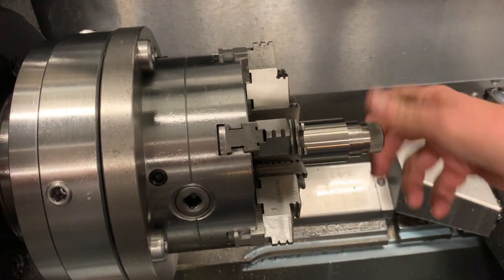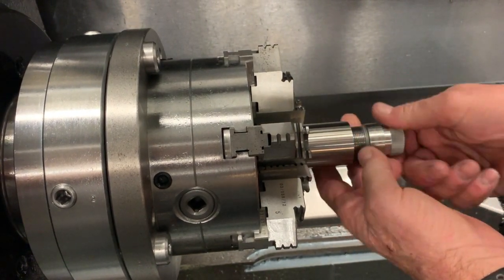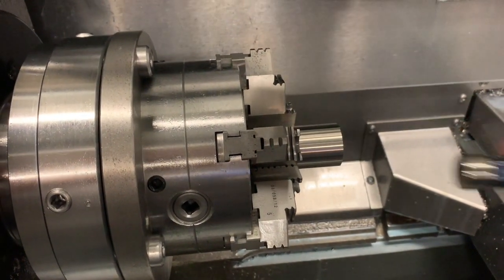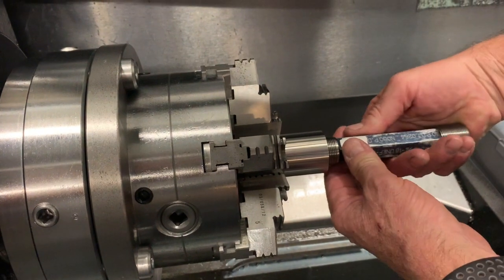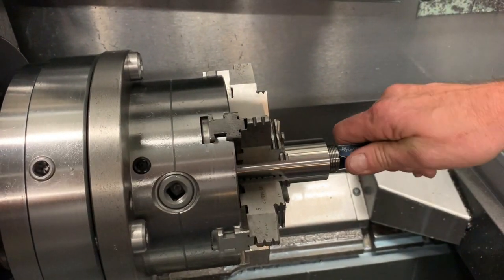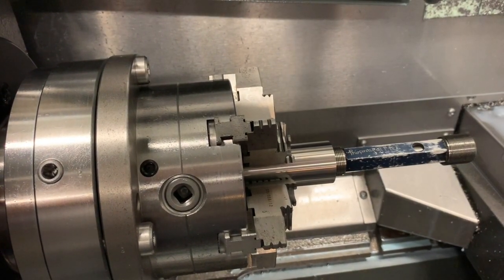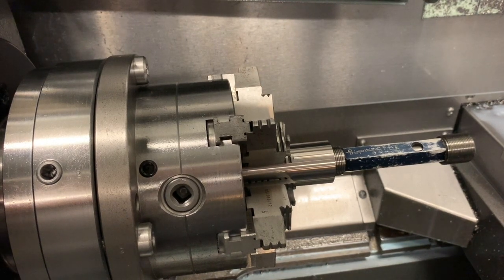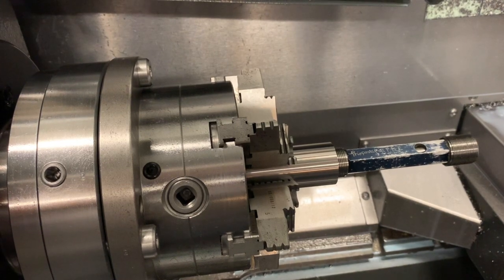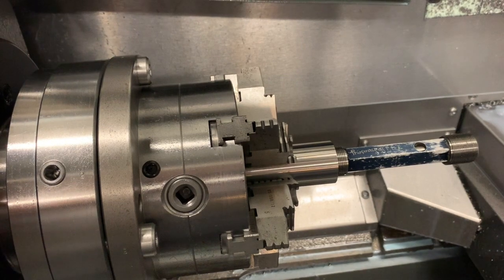That's our go qualifier. Then we have this ground gauge at 1.0264 — that's a no-go. That way the threads are between 1.025 and 1.0264, so you can depend on our actions being within that tolerance.